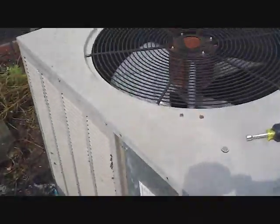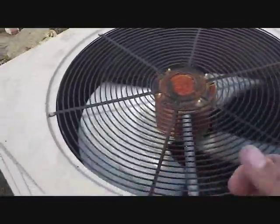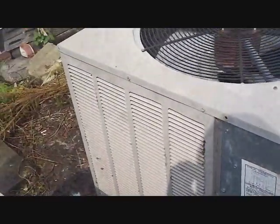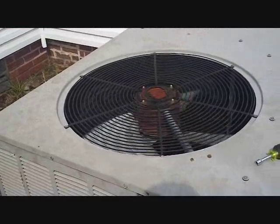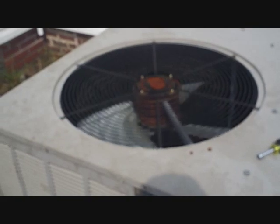We're all running now, cleaned off the coil, outdoor fan's good, a lot more discharge now than there was before, and everything's good to go. The capacitor's changed out. This one's actually under warranty, believe it or not — in 2004, there's a 10-year warranty on this stuff from Goodman.